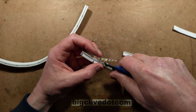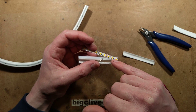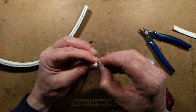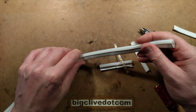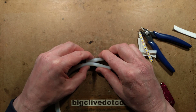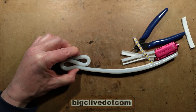So that's ultimately it — it is LED tape inside a diffused medium. It's fairly standard looking thin LED tape. Now I'll look out for those extra pads on other tapes that might be used for applications like this. The LED tape is firing sideways so you don't see pinpoints, and then it just comes through on the front on that diffused material. That loose tape also means you can flex it within reason — if you flex it too much there is a risk you'll crack LEDs off the circuit board, but it does handle fairly tight shapes.